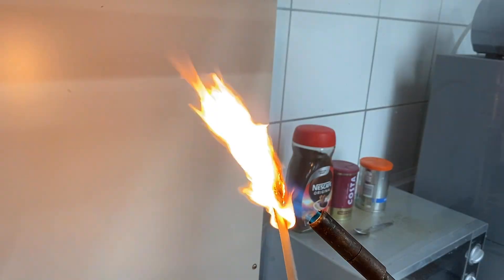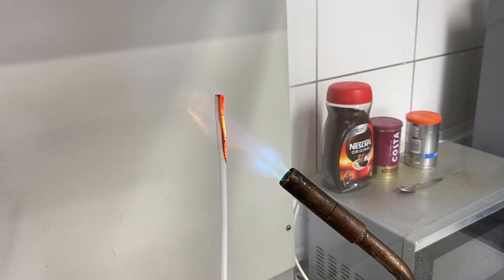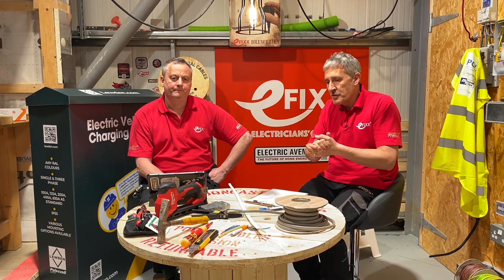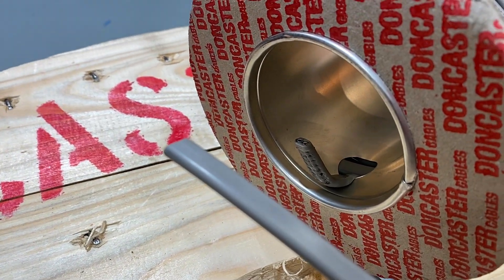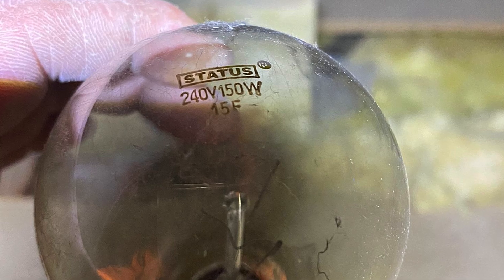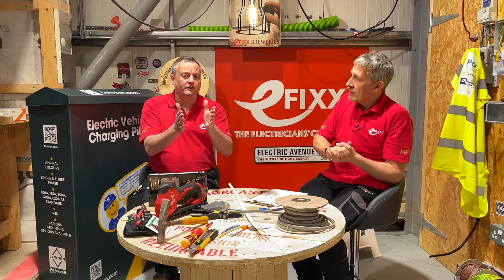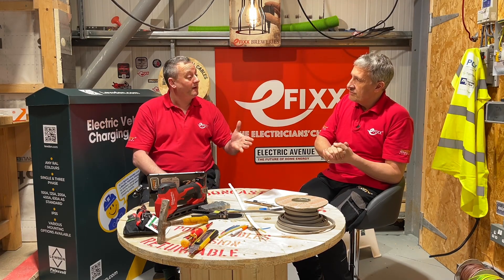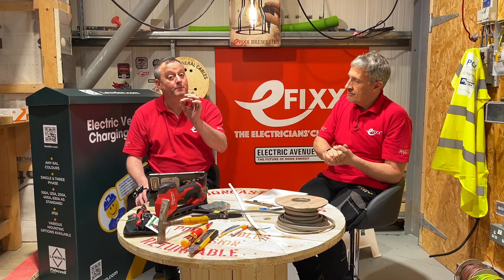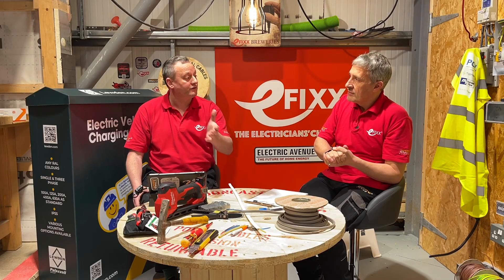You can clearly see the grey stuff gives off that black dense smoke, but the non-halogen stuff we're now moving towards doesn't. We're getting more fire aware. One of the subtle differences in the standard is harmonisation with Europe — you can't get a 1mm twin and earth in Europe, and that's been rolled into this new standard. The smallest cable you'll be able to get is 1.5mm². All conductors should technically be classed as live conductors; the insulation raises temperature, hence the 1mm is gone.